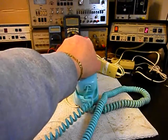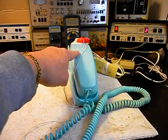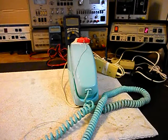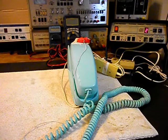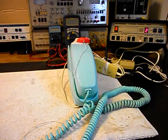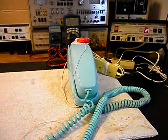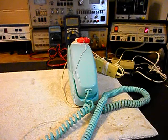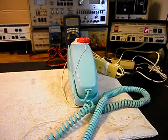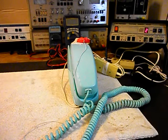So we can hang our unit up. Now that we know that this unit is ringing in on a ring cycle, it's dialing out, we have transmit and receive. Since the issue was the bell, we're going to go ahead and try that one more time with the analyzer, and I'm going to let it ring a few times. So we'll go ahead and send a ring cycle. We'll let that keep ringing. I'll let it go one more time and we'll give you some dial tone.